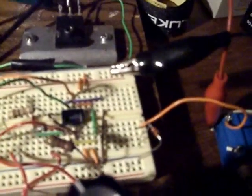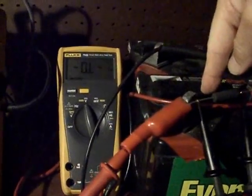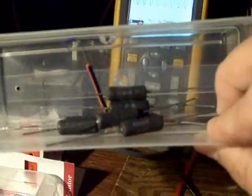What I want to show is this setup here with Parvy's recommended setup for the probes. Channels 1 and 2 are basically across this shunt — the current sensing resistor. Right from the positive terminal. And I've got the multimeter here showing the 12 volt battery voltage of 12.61. This is a 0.25 ohm current carbon sensing resistor — calibrated 5% carbon resistors at 0.25 ohms.